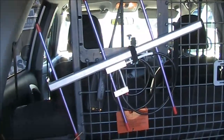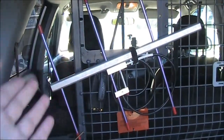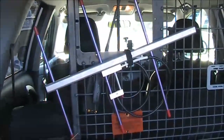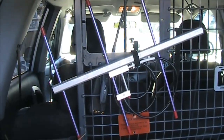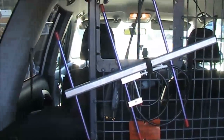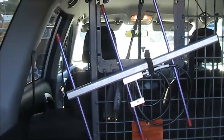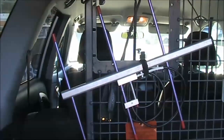So, on what frequencies does each balloon transmit on? Like you mentioned, Reedy on 70 centimetres. Okay, so Reedy is almost always on 70 centimetres. Wennett is also on 70 centimetres, on 441.2. And the cutdown payload is also on 70 centimetres, on 431.65.